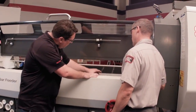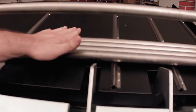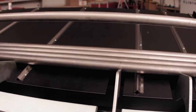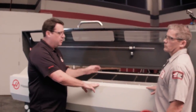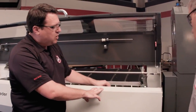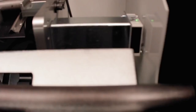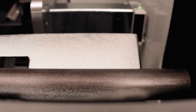Another feature I really like are these stainless steel rails that allow the material to slide down nice and easy and ensure we always get a pickup and transfer. One of the things we can still do with this Haas bar feeder is have random-length bars in here, because with this optical sensor that measures each bar that comes by, you can load in random lengths knowing that the machine will measure the bar as it goes in. Let's go take a look at the interface.